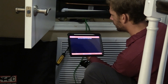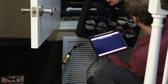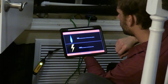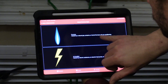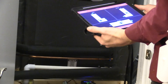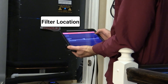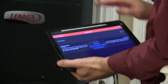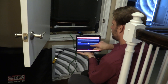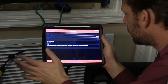I'm going to run the test for MeasureQuick. I'm going to turn these on, make sure it actually turns on, delete, and connect to each one — here we are ready to take our measurements. Gas, propane, or air handler — I'm going to select air handler as my application, upflow, and then filter location, which would be either a slot in the duct or in the cabinet, multiple filters, or filter grill — this is a filter grill. My design cooling is 350 CFM per ton here in Florida, which is more ideal for our climate because we're focusing on dehumidification.